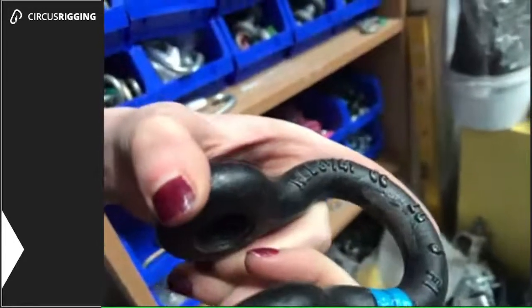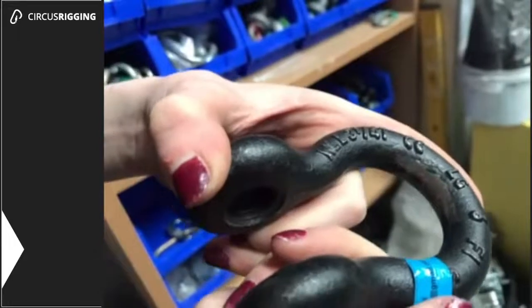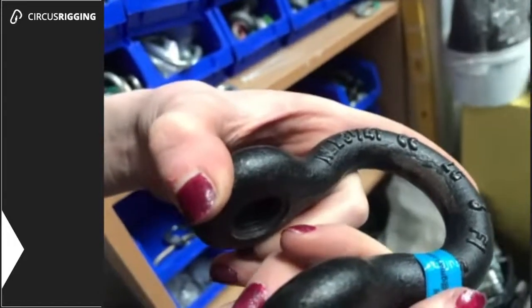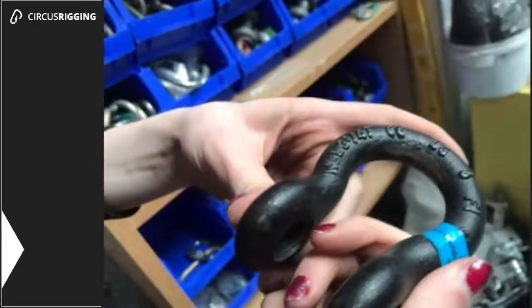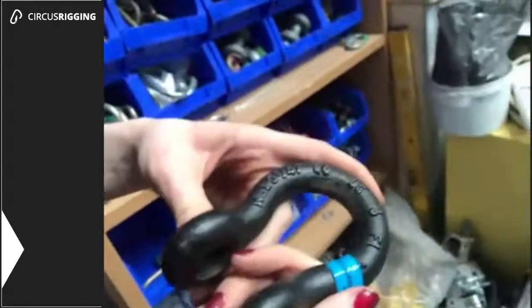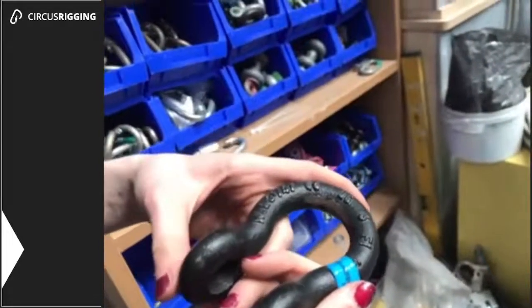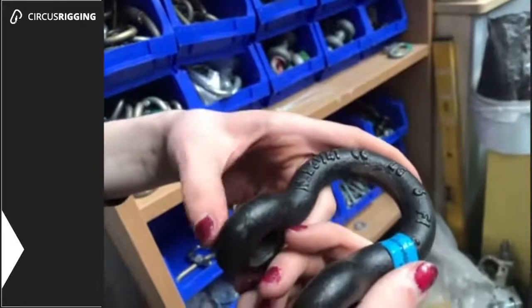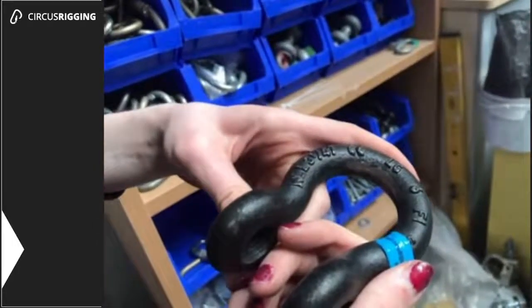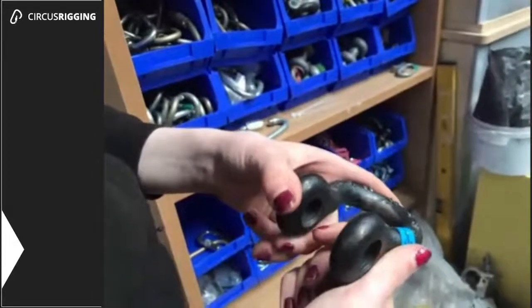Now, what you've got to be careful of is if that, for some reason, offends you aesthetically, I can't think it would, but if you're worried that people can see the shiny surface, then don't paint it again. If you do paint it again, give it a good clean and take some of the surrounding paint off before you paint it black, because you could easily be literally papering over the cracks. Right. Okay. Really important. Same with trusses.